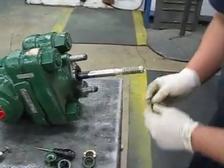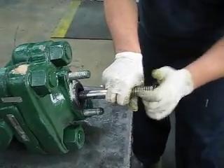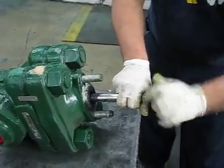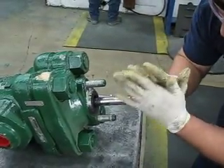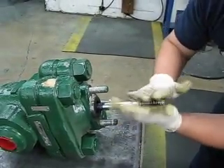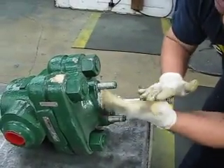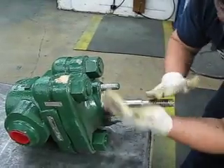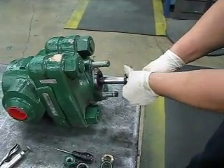Okay, get your first packing. You just want to screw it on the stem — you don't want to force it all the way down because you're going to rip it. So just kind of screw it on there. By the way, it goes counterclockwise. Okay, go ahead and slide it down.